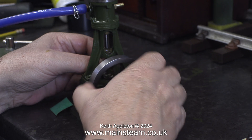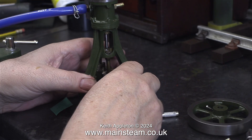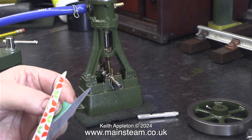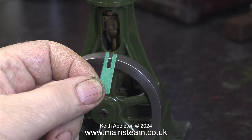The crankshaft is trying to move the big end brass to one side. This was not an issue with the engine as I originally received it, because there was no gland packing in the glands, the piston was a rattle fit, and the big end brasses needed adjustment — and that's why it's not running too well.